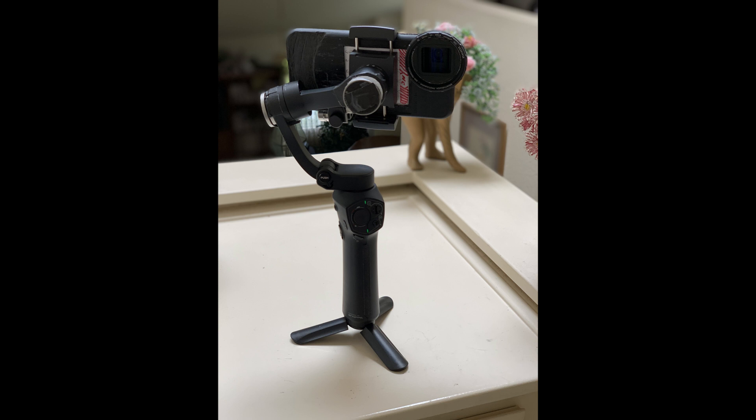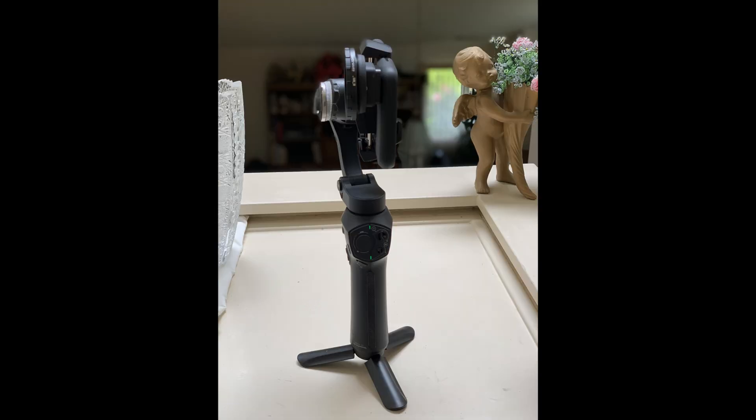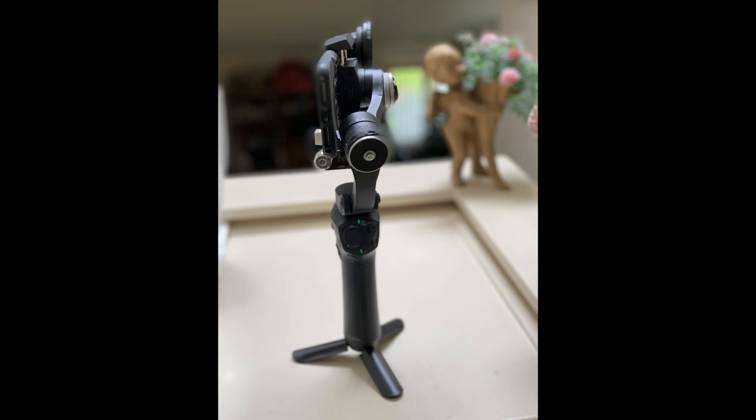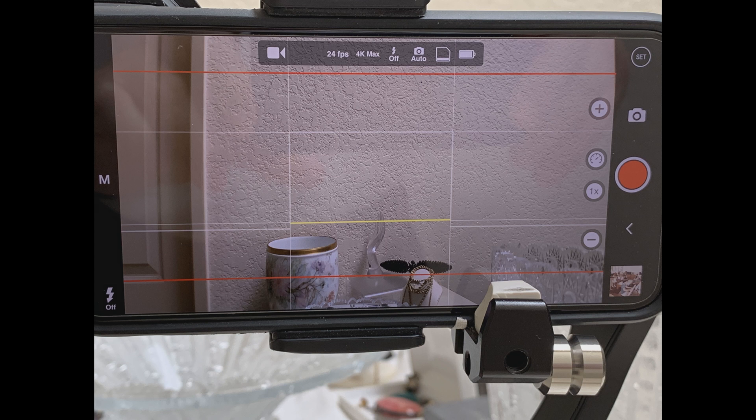Here you can see from various angles. I put a counterweight — a little one-inch diameter counterweight — on the roll servo and also on the pan servo. One of them has 12 grams, the other is 22 grams. If I add heavy lenses or heavy filters, I have to screw on a bit more.